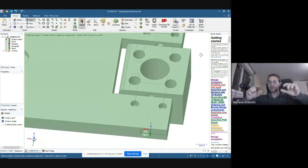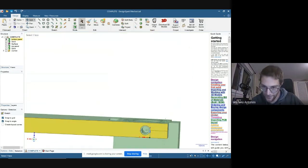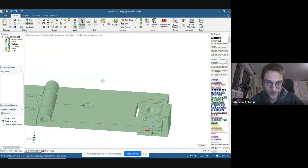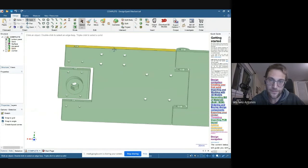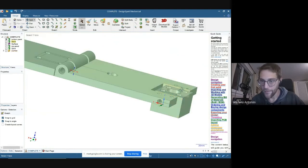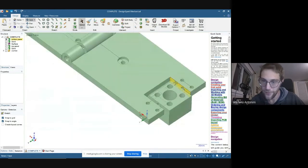This way we have the rotation of the panel exactly centered and very smooth, because it's through six bearings basically, and it's perfectly centered with the middle of the panel. So that avoids any additional error. And the same thing is done on the top panel for the other pivoting panel. Here is where the captive nut goes, while on this side the motor is mounted on the bottom. So here you attach the motor, and there are screws to anchor the motor.